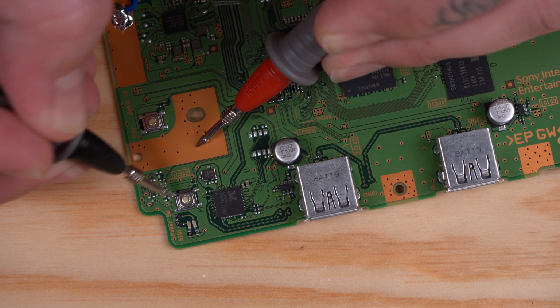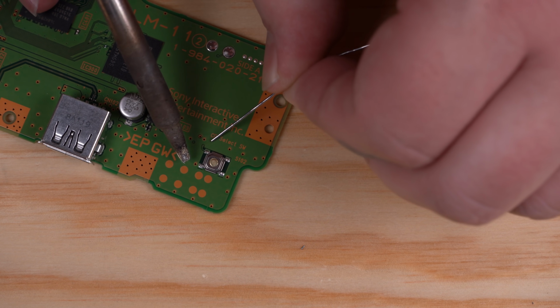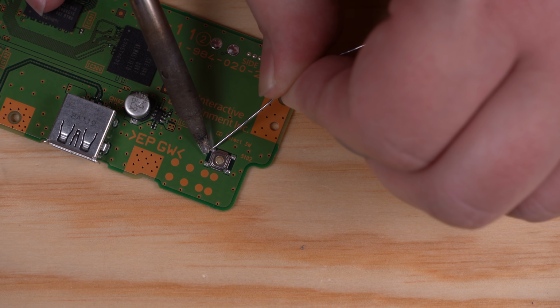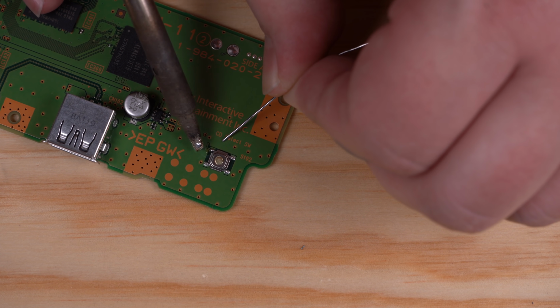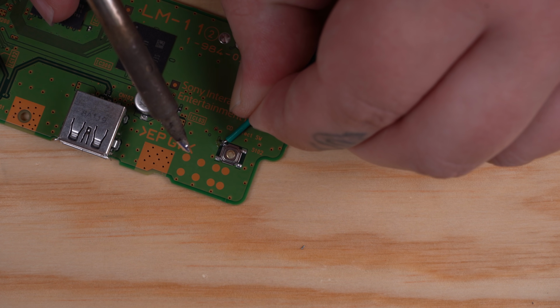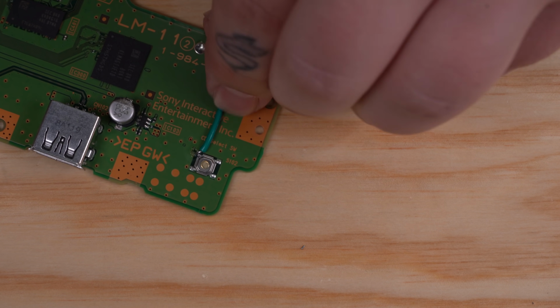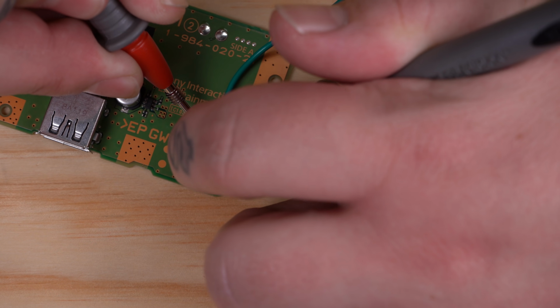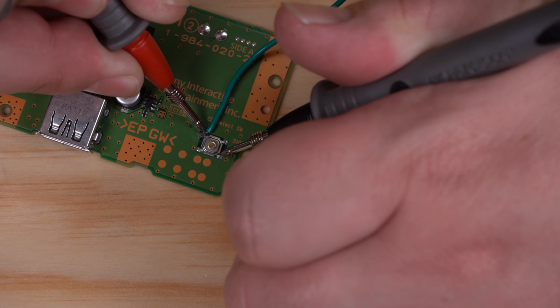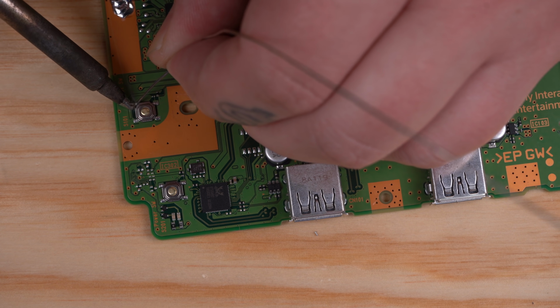You see the bottom 2 pins on each momentary switch are connected to ground. Since both of our boards have the same ground, they're already grounded to our Raspberry Pi. So we'll just need to attach 1 wire to each of the momentary switches. And it's always a good idea to check continuity as you work to make sure you're not shorted anywhere. This will help save you a lot of troubleshooting time later.